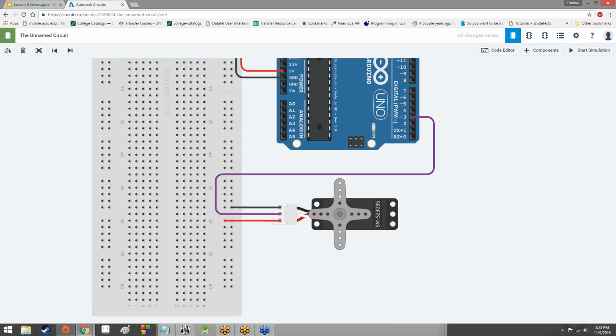So analog can send a whole range of values from full off to full on and anything in between. Digital can only send either full off or full on. However, here's the thing. Sometimes you get stuck in a predicament. You've got something that sends out a digital signal, right? It can only send out off or on. You've got something that can only read an analog signal. Now you have a problem. You want to send a range of values, but you can only send out a digital signal. How do you do it?